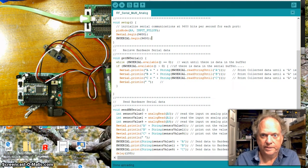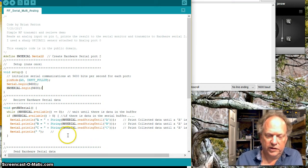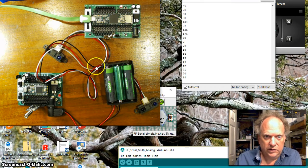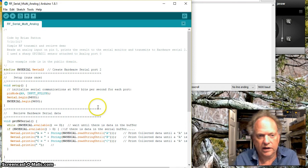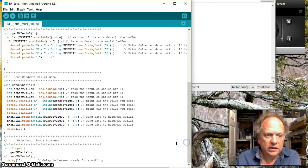Now let's go a bit higher — we'll use multiple sensors. I'm going to use two Sharp sensors, and also a photoresistor hooked up to pin A9, wired directly between the signal pin and ground. I've made that pin a pull-up, so there's a residual charge on the pin all the time, and the photoresistor is its pathway to ground. We'll be monitoring how many electrons are left as they try to escape through the photoresistor.